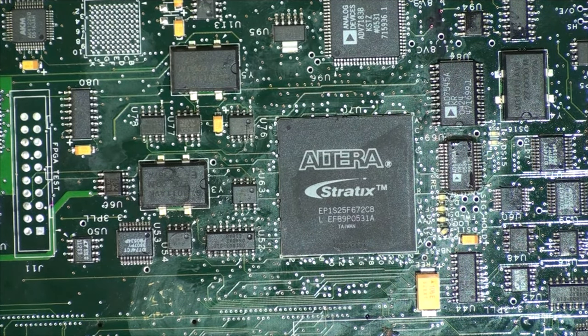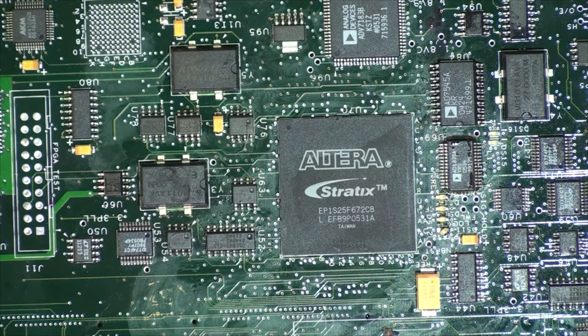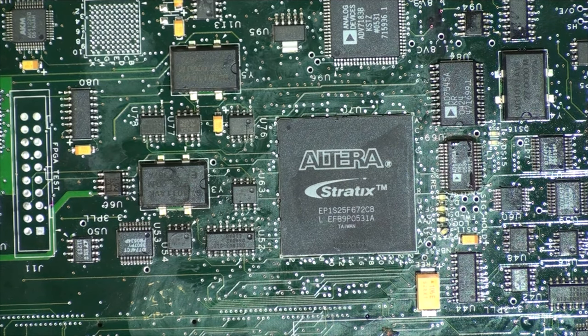This is how you do the reflow. If you're doing it for the first time, I suggest getting a bad board and just trying to reflow a chip, or an old motherboard that still works — desolder it and solder it back, then turn it on and see if it works. If it doesn't, practice a bit more. It does take maybe five or six times of re-balling before you get the feel for it. I hope you enjoyed this video — don't forget to subscribe and like. I'll see you next time. My name is Max, bye.